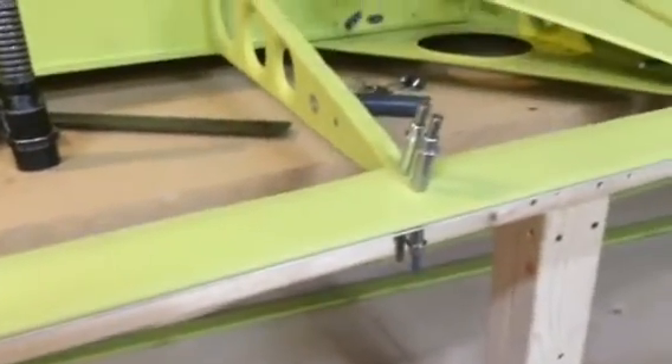Because I didn't like the way this was working out, I took my squeezer and mashed the areas where it's going to meet the ribs flat. You can see it did it there and down there. I did it with my pneumatic squeezer and you could see it put some dents in it — it just wasn't an elegant solution. I felt like I was getting to the 99 yard line on this wing and then going to drop the ball before scoring.